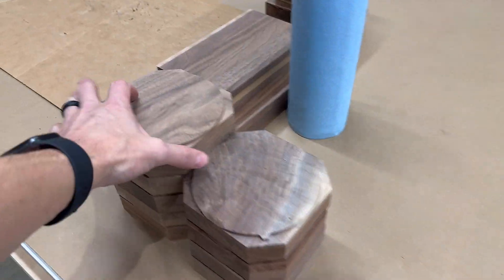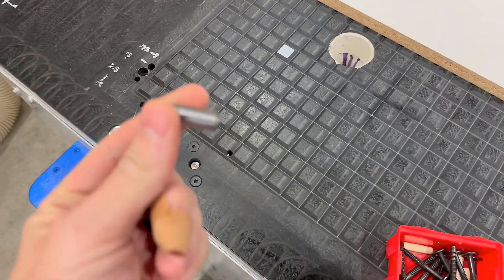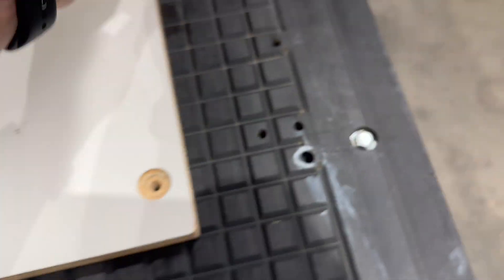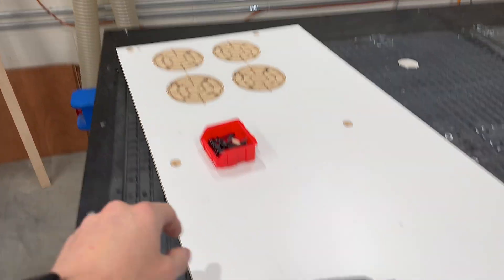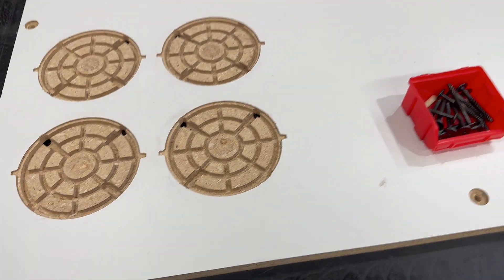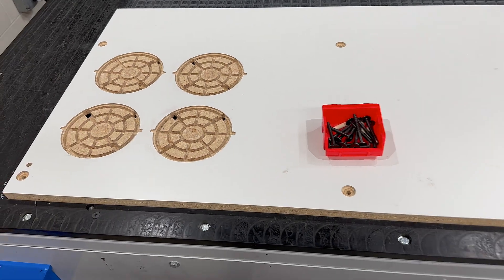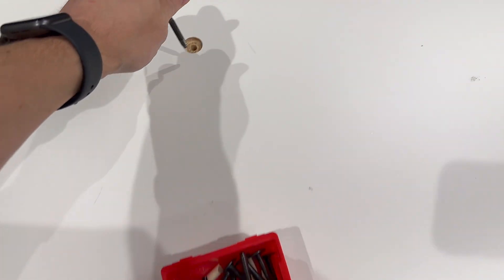This specific jig is made for our Chemex — it lets us do the second operation. Same mounting method: these alignment pins are slightly smaller, I think 3/16". Drop the fixture on, put that end in first, then slide it over until the hole hits and drops down. When we machined the backside first and then flip it over, it's in the perfect spot and hasn't changed since the first setup.